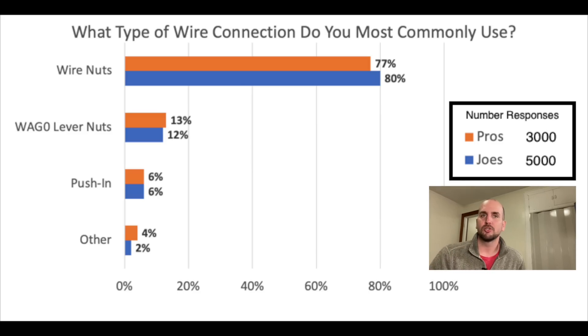There's some miscellaneous two to four percent using others — there are a few other things on the market. Good, better, best: wire nut is good, push-ins are better, and WAGO's lever nut — specifically the 221 — is the best. Agree or disagree, let me know in the comments. Links to all these connectors are in the description. For the DIYer doing electrical work multiple times per year, I recommend getting a multi-pack of WAGO 221 with two slots, three slots, and five slots — that covers you. Keep the kit, and whenever you need to replenish just get the specific connector you need.